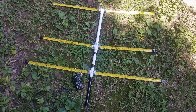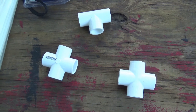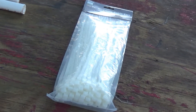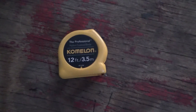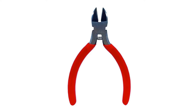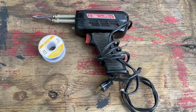Here's a list of materials you'll need: at least 3 feet of 1.5 inch PVC pipe; two 1.5 inch PVC crosses and a 1.5 inch PVC tee; a 1 inch width tape measure you're willing to sacrifice; some large zip ties; at least 2 hose clamps; 50 ohm coax such as RG58 or RG8X, one end with no connector, the other end with a connector of your choice — in our case a standard PL-259. A small piece of wire, at least 5 inches, to use for the hairpin match. Tools you'll need include a marker, a tape measure you are not willing to sacrifice, a flat screwdriver, a pair of tin snips, a pair of side cuts or scissors for trimming zip ties down, a small hand saw, sandpaper (coarse grit is best but any should work), solder, and preferably a Weller soldering gun. A soldering iron might work, but the Weller will work more quickly with the tape measure elements.